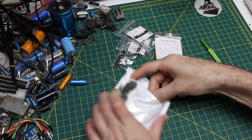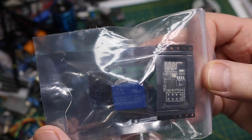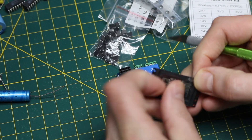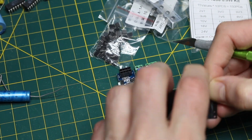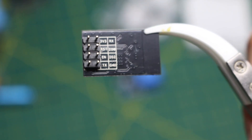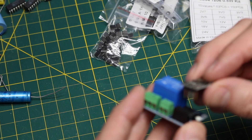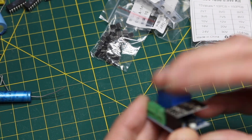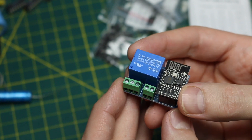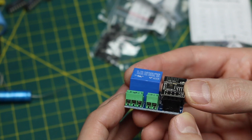And this is one of those ESP8266 relay board modules. It comes with the separate ESP8266 module with the 8-pin header on it. It has a few basic pins for power, reset, serial communication, and basic I/O capabilities. These things have been around for years, and I believe you have to hook up some sort of a separate UART programming interface, maybe on a breadboard. I'll have to look up how to get this thing programmed.